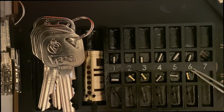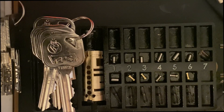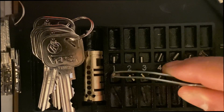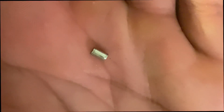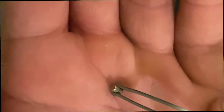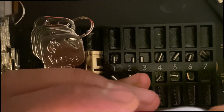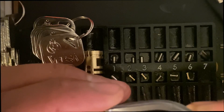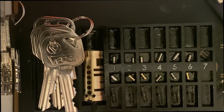Pins five and six and the ones that don't are probably too small to have them, which is a very nice anti-bump and pick feature. On number one we have got this slight bevelled pin — probably an anti-bump measure. I'm guessing this is quite a stiff spring. I think they're all quite relatively the same consistency, and then pins two to six are these quite nice spools — I'll get these up for you as well.